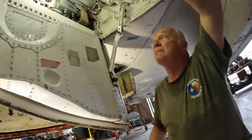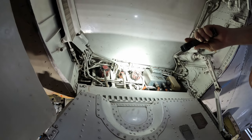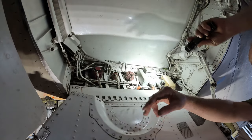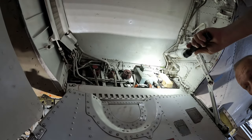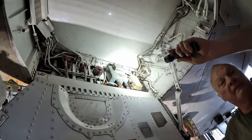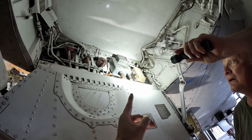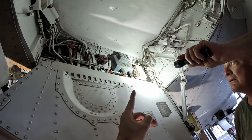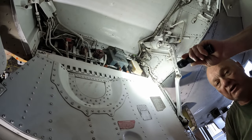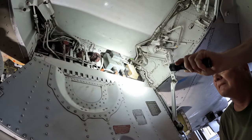This airplane has three hydraulic systems: PC1, PC2, and the utility. This is the quick disconnect for the PC2 and this is where you service the PC2 reservoir. This is the G-meter counter, which is different from the one in the cockpit. You've got your refuel switch behind here — that's where the ground crew would open and close valves to refuel. When the battery's hooked up and you hit the switch to refuel, you can hear the valve go.